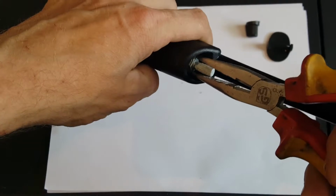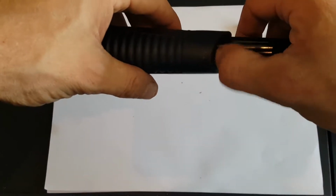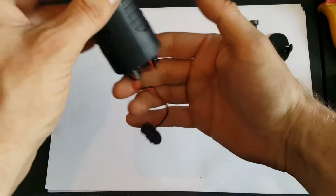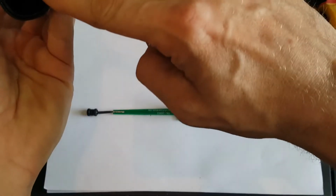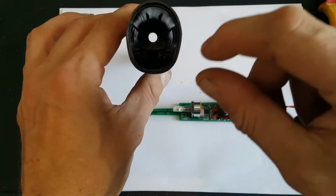Now you want to come down here to the other little bolt that's under here. Now to save time I'm going to pause just now, but all we've got to do is undo this bolt here. Right, well my bolt's undone. It's all the way up. It doesn't seem to want to come back any further because of the masking tape, but I'm just going to hold on to the handle like so and push it backwards through. Now the bolt falls off, bolt's here, and this handset, if you just wiggle, everything comes out in one. Now this is lying loose, and I will state now that when it goes back together, this rail on the side, the edge of the plastic, actually bites into a groove down inside here. See if we can show it. I don't know if you see it, but just down here it's a little ledge, and on the other side as well. It's just a little rail for it to run through.